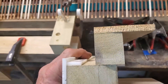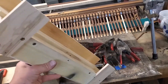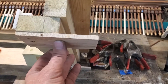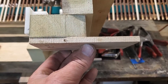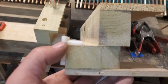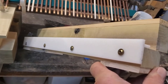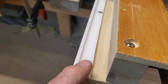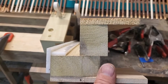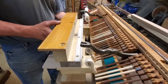Here's the next part that goes on top of the base. It's got this part right here so that you can use clamps — I use these spring clamps when I put it in place. It's got this horizontal block, and right here is where the bottom of the hammer sits against. I've got plastic in there because the glue won't stick to it and I can clean it up easily. So there's a front lip and another piece — two pieces — and the hammer sits right in there. Then this is for the top stop, with another thin piece going across the top with an overhang that I can clamp to.